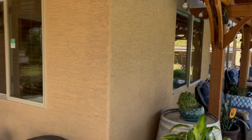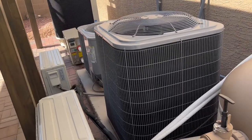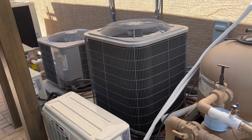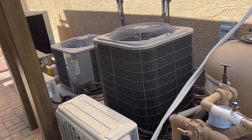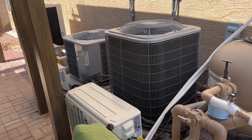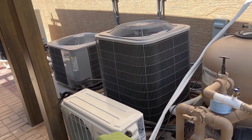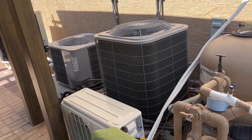I just wanted to give you an update — we got both of those main air conditioners able to start up and run. I think I had to hook up another 12 panels to get this four ton to fire up. If I had another four batteries to my battery bank — I'm just using AGMs, 100 amp hours — so if I put eight batteries on there, two sets of 48 volts, I should be able to fire up both air conditioners at the same time. Right now it starts up either one fine, no problem whatsoever. But it won't start both at the same time — just too much of a draw on that four ton, which draws maybe 10 to 20 more amps than that three and a half ton.